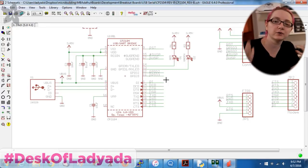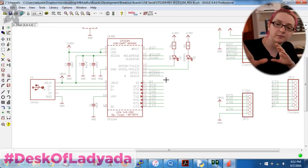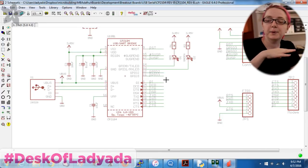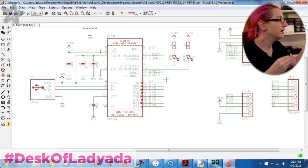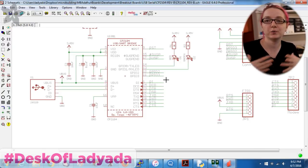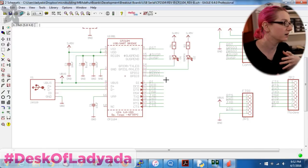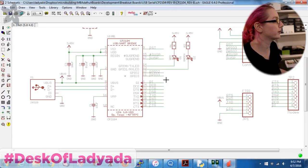There's like get ring, set ring, get RTS, set RTS, whatever, all of those control lines, and like send byte, receive byte. But there's no generic GPIO control for those. There's no way in the driver for us to do that. It just doesn't exist. These are kind of extras that are tacked on. Okay, so how do you control them if you want to?